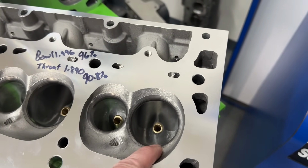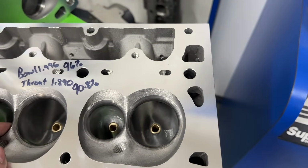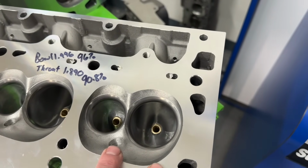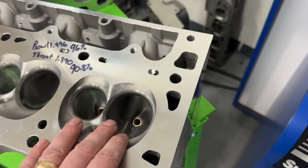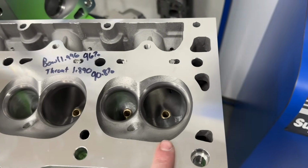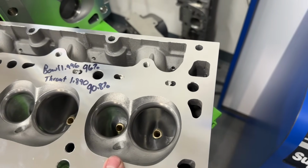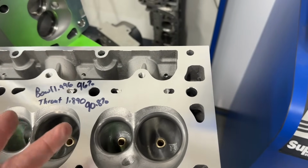In a 2 valve head, I try to shove the biggest intake valve in the head I can put in it. You're like, oh, you're already messing it up. Engine Masters Challenge, when I competed in that, taught me that for sure. One of the first guys that I saw, I thought the same as maybe some of you: no, that smaller valve has more velocity and you're going to make more power. Yes, but having a larger valve allows you to do something else. Because I saw Tony Bischoff, he had a 2.19 valve in a small block Chevy. And I was like, wow, that's crazy. And a 23 degree head nonetheless. So I was like, wonder why? Well, it takes some theory to figure this out.